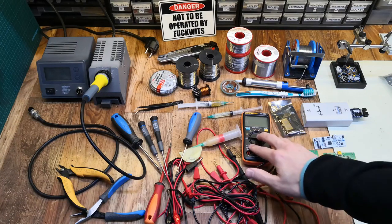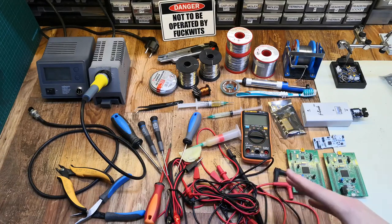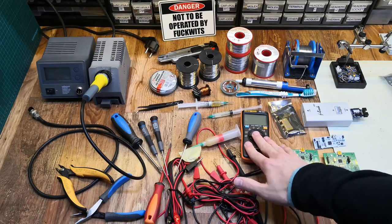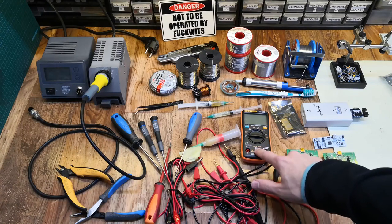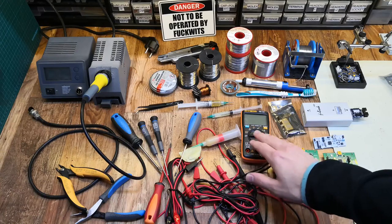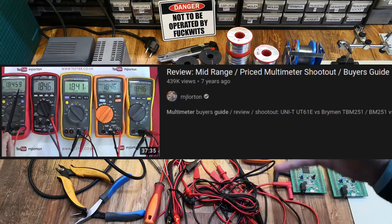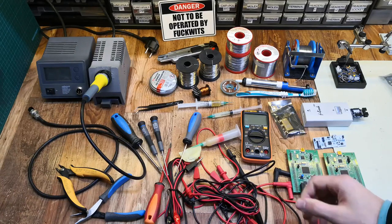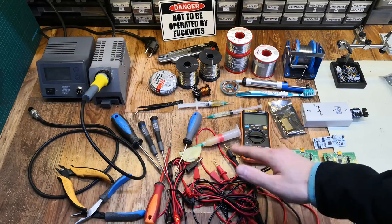The next thing you're going to need is a multimeter. There are multiple videos online on this topic — I'll post some below. For a beginner or intermediate, buy around 50 euros worth of multimeter. Something like this one is under 20–25 euros and is very capable; it agrees well with my main multimeter, but it doesn't have as good protection for measuring mains and other things, so I wouldn't recommend it strictly for everything.